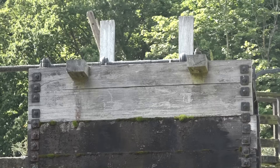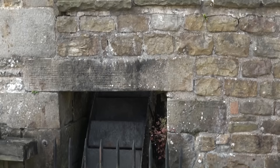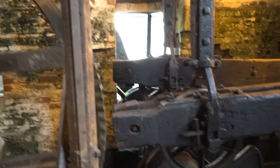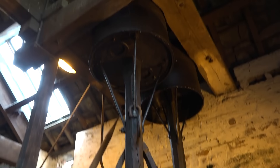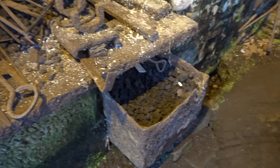This upper rod, when twisted, moves a wedge which controls the flow of water from the main upper tank. Gravity is kept switched on at all times, so that all that potential energy is just ready to go. Here, there is another control regulating water to a second smaller water wheel that powered the bellows. There were once four water wheels in operation here. This flow-adjusting control has a simple but effective way of holding a desired rate: teeth on the stick and a peg to rest one on.